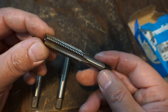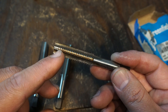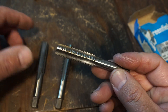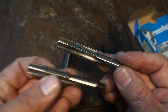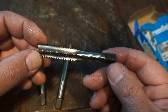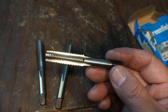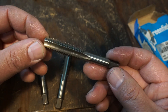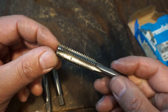Your next one is considered a plug tap - it's a hand tap but the grind on it is a plug. You have what - three, four, maybe five threads total that have an angle ground on it. You can look at the starter tap and see how much further back the grind goes. The plug tap is going to be one of your most common taps out there in the market. If you run to the hardware store and need a tap, chances are this style of tap is going to be hanging on the shelf.